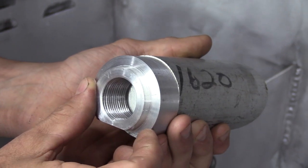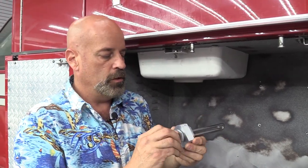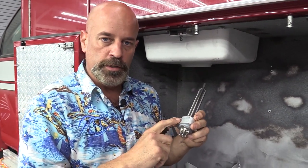The holder for that started off as a solid aluminum lug and I machined this part out of that. What I did was turn it around so it could be mounted from the inside of the unit — simply screw it in from here, screws in like this, quite nice, beautiful. So what I'm going to do is mount this in and weld it into the side of the box.